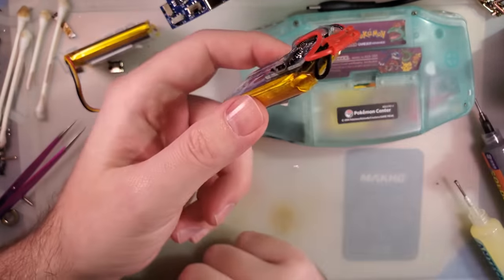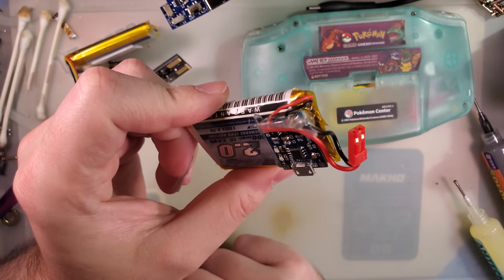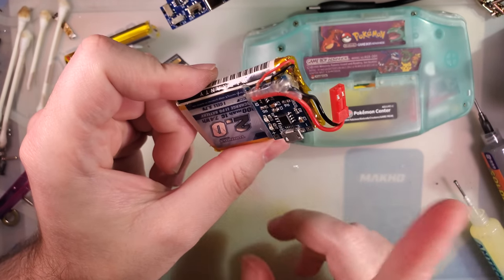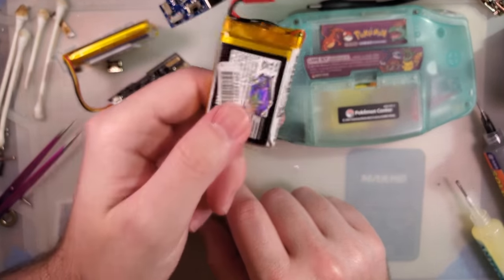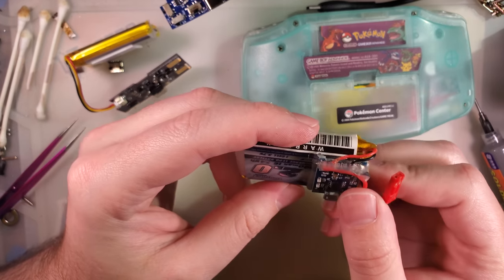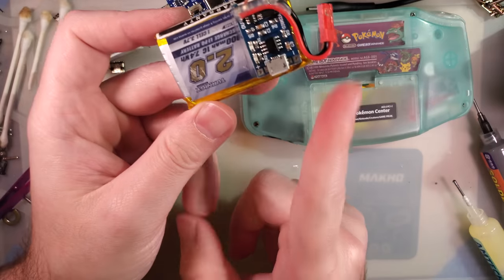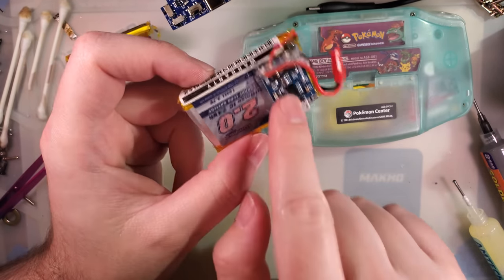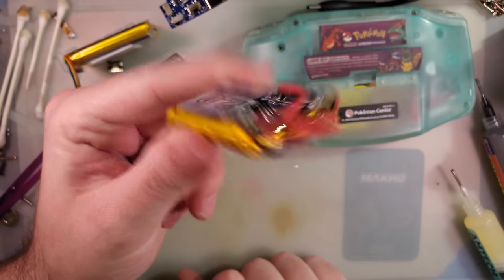I think literally my only saving grace is that there's probably like 2 or 3 cycles on this thing, and except for one of them, every single time I was just topping it up from like 70 to 80% back to 100. So in this specific case, it was probably fine because I just never played this Jesus thing. However, for anyone else out there that's thinking about doing one of these battery mods, no, bad, stop it. You will kill your battery with heat, and if not, you will kill it from low voltage. There is literally no low voltage shutdown on this thing.